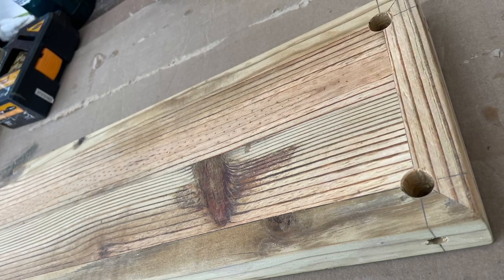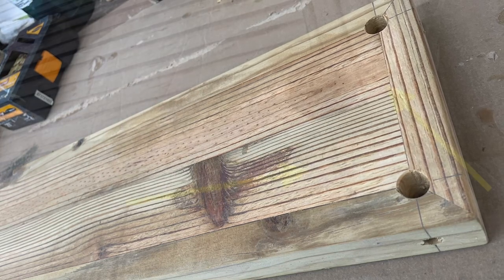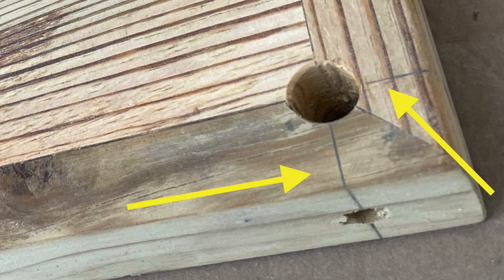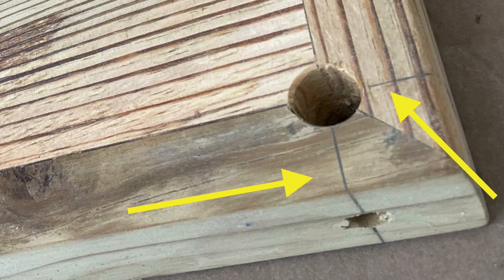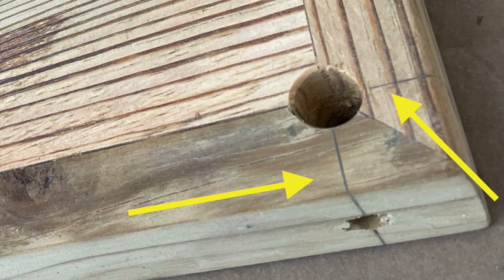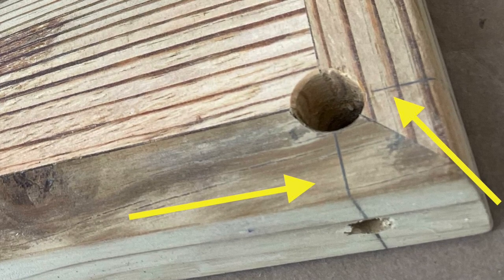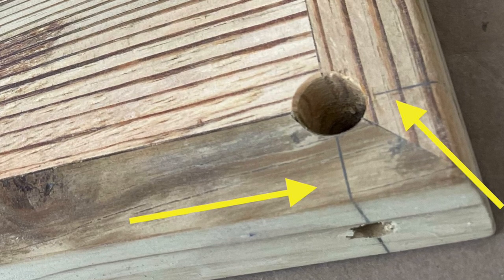The box top itself has some wonderful markings and character in the wood, the knots of the wood I wanted to keep. And I just marked the X and Y axis. I built a frame again with the miter saw around the top so we wouldn't be dealing with the end grain to give it a little more support. Put some half inch holes there, as you can see, in the four corners so that the rope I would use as rope handles had somewhere to mount.